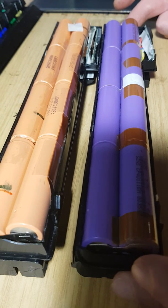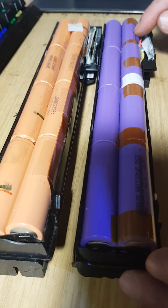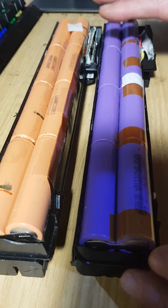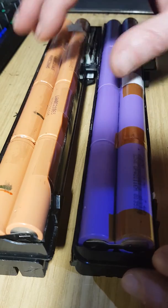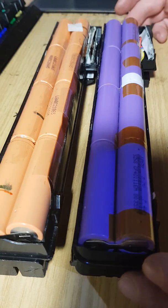And as I said, all you've got to do is pay a little bit more attention to what you're doing, and take the model numbers of the batteries that you're using, or the cells, check them up, and compare your data before you start mixing. And I wouldn't advise mixing, but if you start interchanging packs, pay close attention to that.